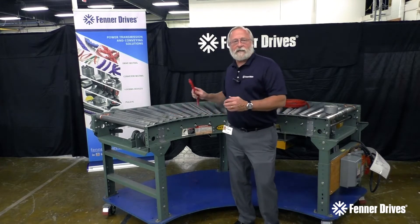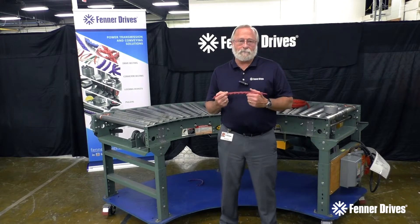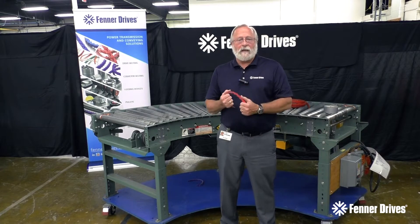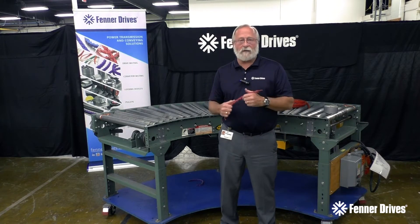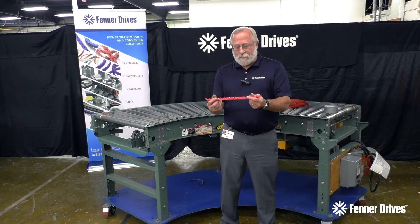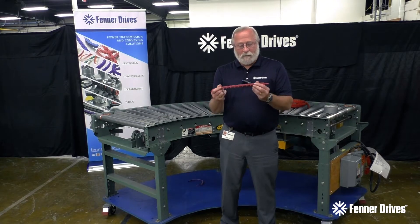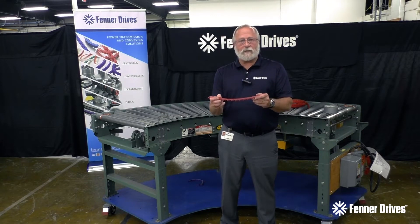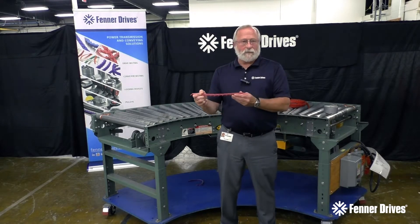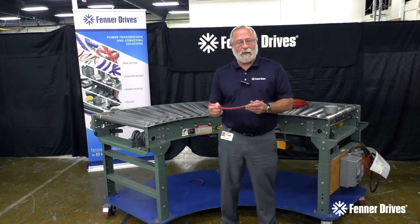If you're not running a 9-16ths round belt, you're running B section V belts. These belts can even be more of a problem because they sometimes require more disassembly to the conveyor, and their life — I've heard anything from six months to a year. This is the same style of link belt that we just talked about with our round belt. You can see the tabs on the bottom, but we've applied a flat surface to the top of it. This allows us to snub up against the roller, run flat and smooth, eliminate vibration, and power the live roller.